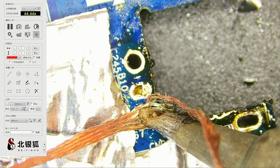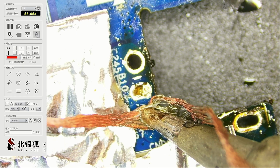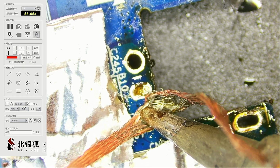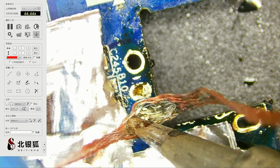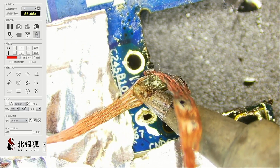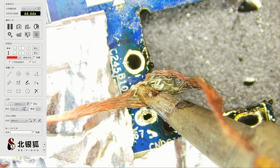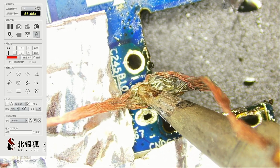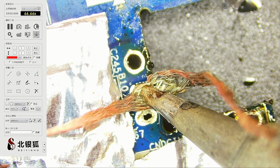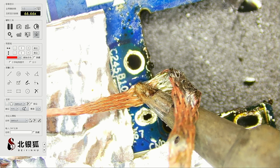All right, so I had to cover everything up with the thermal tape because components are flying off the motherboard. I almost always cover, like 99% of the time. I was under the impression that this is not a fixable laptop, but we found the capacitor that was shorting, and I'm not sure if the capacitor was shorting because it was detecting the spillage, or because they tried to do something about the jack.